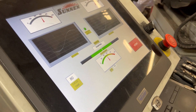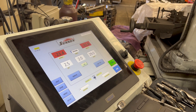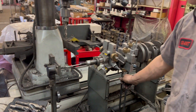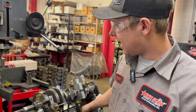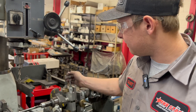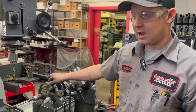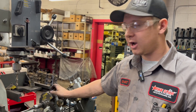It's starting to read — there we go, now you know your to-do list. In this instance, we like to take weight out of the counterweight. We can see we need to take weight out at two degrees, but we're off the counterweight. So now we're going to have to add metal on this side to bring the difference in weight over to this side. This machine only tells you where to drill weight from, and we can't drill anything over here. So we'll weld — weld with a heavier metal into some of the existing holes on the crank. That should bring the off-balance onto the counterweight and we can drill a little bit, or hopefully bring it all the way in just by welding.